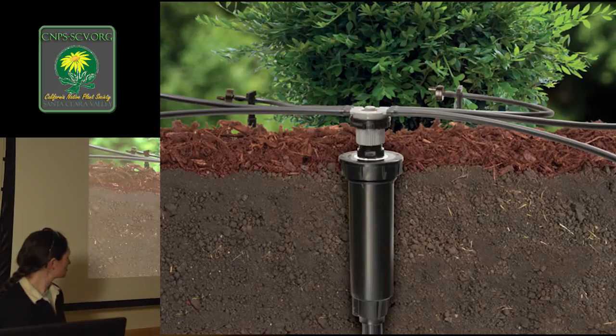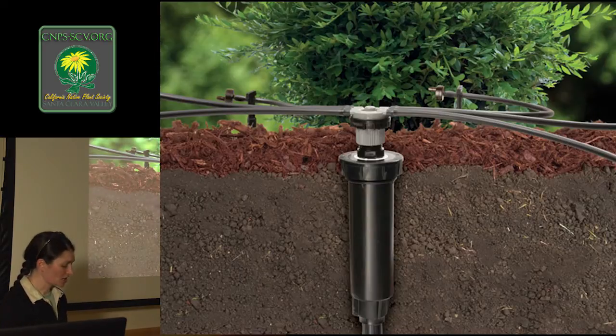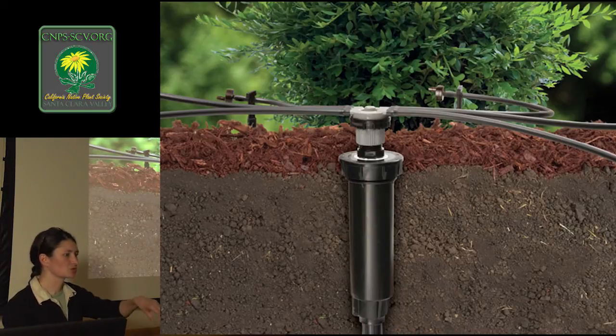and this would be the sprinkler head. You just unscrew it and screw in the new drip conversion piece. And then it has little portals, and you just take the little drip hose out to your plants. So it's pretty easy. It's like playing with Tinker Toys. Sometimes putting the little pieces together is harder than I remember from when I was five, but it's a pretty easy way to put in irrigation if you already have sprinkler heads out there. And if you don't use all of your sprinkler heads, you can just screw a cap on the ones you're not using to close them off.